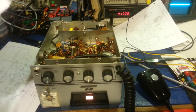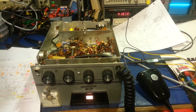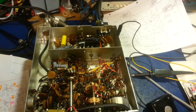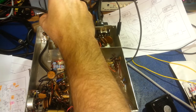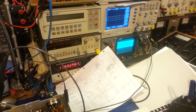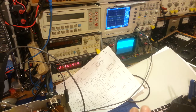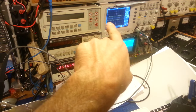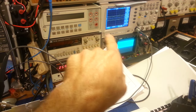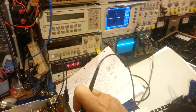That's what I thought initially. But it actually appears the oscillator circuits are working just fine, and here's where it gets strange. Hooking up the oscilloscope directly to the coax output jack, I have the span set to view an actual waveform. The 25.365 MHz signal looks scrunched together, but if you notice there's a little ripple — that ripple has exactly as many bumps as the waveforms you'd see looking at the 1.75 MHz signal separately.